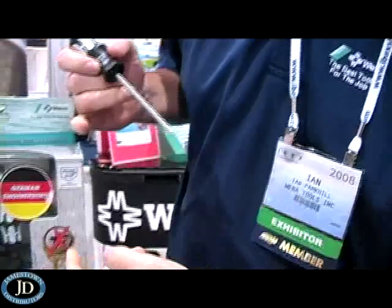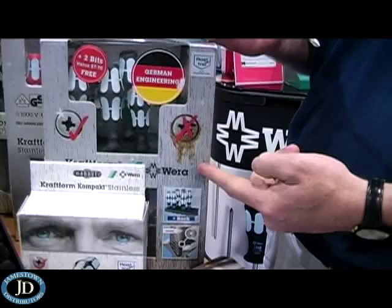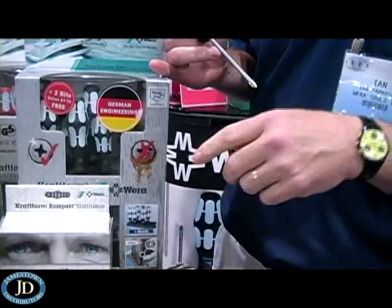The reason why is to solve a problem that everybody's familiar with if they've ever seen rust bleeding out of a stainless steel fastener. It's not because the stainless steel screw is corroding — it's because the standard screwdriver used to install it has left some carbon steel residue behind, and that's what actually starts the corrosion and bleeding out.